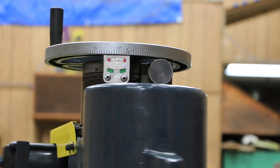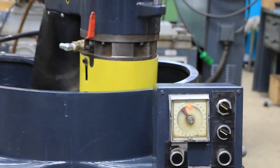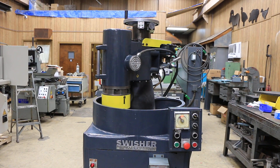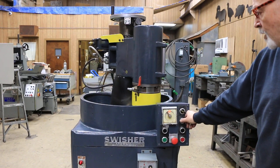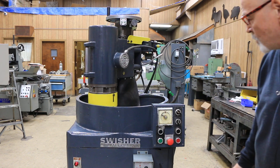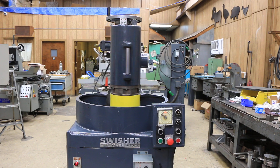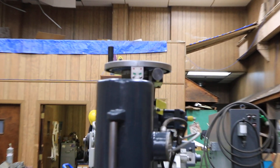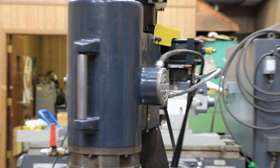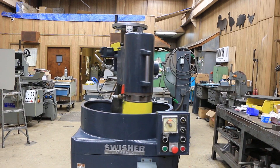At the same time it's doing that, this needle here is counting down to zero. And when it gets to zero, the feed there will stop. There's no dead stop — no solid fixed stop on the machine. This stops the feed in automatic mode. Now if your part's not the right size, you finish it up by hand. As soon as I shut this cycle off, the needle is going to reset itself. That's our downfeed. If I wanted it to feed more, I can back this up to ten pulses and start this again. Each time we come to the right side of the work, you'll see the feed. It only feeds on this end, and each time it's feeding, this red needle here is counting down to zero.